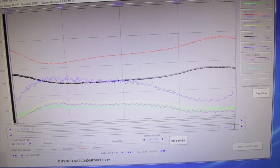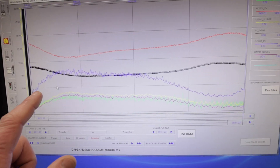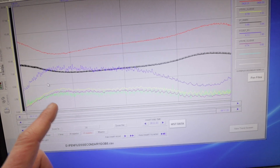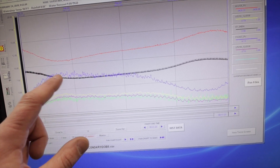Here in SCADA we can see how those blanket levels interact with other parameters. We've got all three clarifiers putting out a depth of blanket over time, and it tracks pretty well with the blue line — our flow. It makes sense that a higher depth of blanket is going to exist at higher flow, and the lowest RAS and mixed liquor concentrations are accompanied by that same high flow.